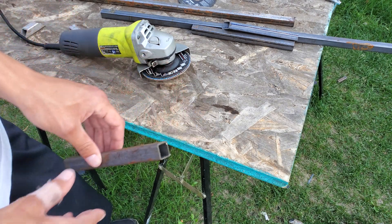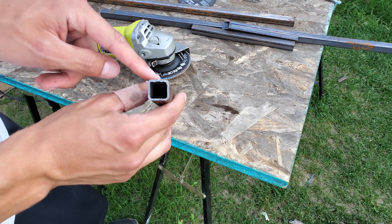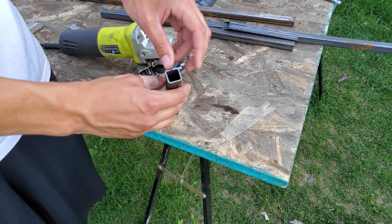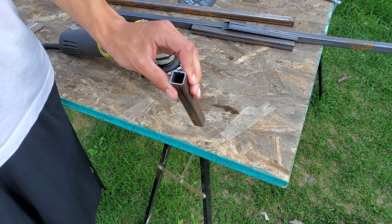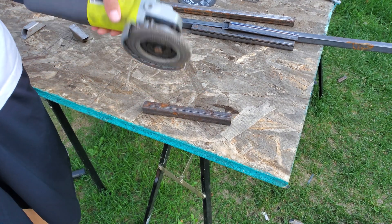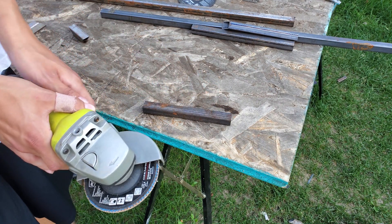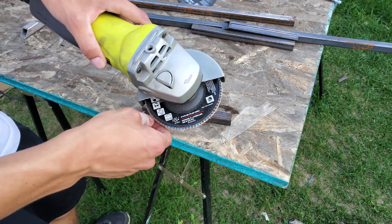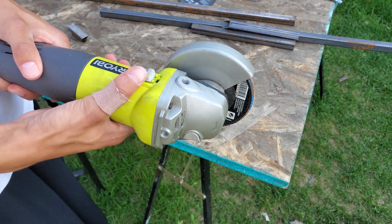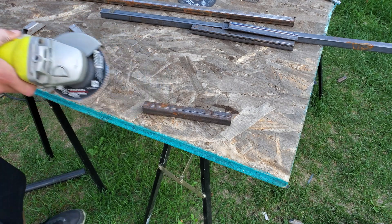Here's a practical demonstration of what the alternative looks like. If you look very carefully at the cross section of this tube, it actually dips down in the middle of all these faces, and that's because when they make this tubing they roll it so they can't get perfect 90-degree corners and they can't have perfectly flat surfaces. That's one of the bigger challenges with doing it the old-fashioned way — you can get these edges but the middle, because it dips down, you have to remove a lot of material. In this case we have a four-and-a-half inch flap disc, 60 grit, and even if you get these in bulk it is still a few bucks a pop, so it's an unnecessary expense to say the least.